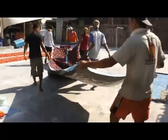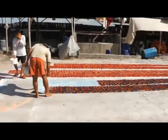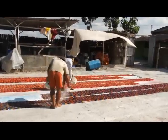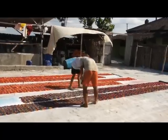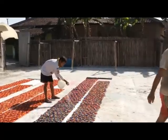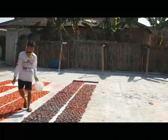Now that the motif colors have been applied to the folded fabric, you can see the workers carrying the long plastic sheet of linoleum out into the bright sunshine. Sun is such an important part of batik production. Since the reactive dyes have not yet been fixed or cured to the fabric, drying them in the sun will fade them slightly. The workers are now sprinkling soda ash, which is a fixative, onto the fabric in a random or haphazard fashion. Wherever that powder hits the fabric, it causes that area to be just a little bit darker than the surrounding areas fading in the sunlight. This increases the random variation in color that is a unique characteristic of batik fabrics.